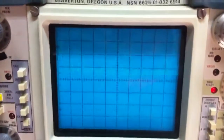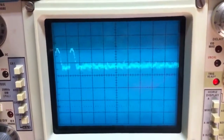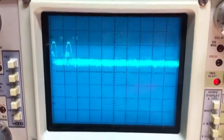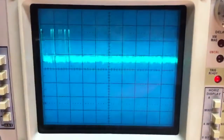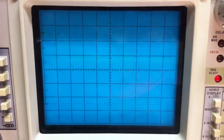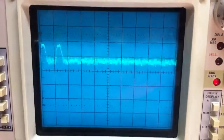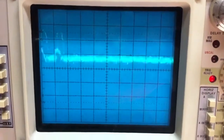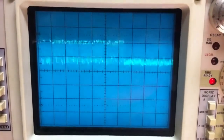That's connected up to an external disk cone antenna, and we see these sorts of replies. Not sure what the big pulses are, but clearly the bursts are transponder replies. There may be a mix of Mode S and Mode A/C, and I've got to figure out what the other pulses are.